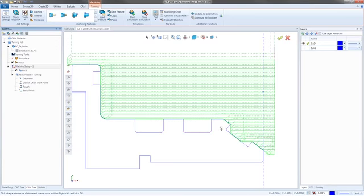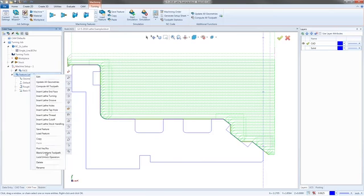There it is. So it did not ignore the angled groove, as you can see. It did go in there, which again, I'm okay with that. This tool can handle going in there and cutting that. I'd prefer it not to, especially if I'm going to set up a tool on that specific angle already. But the only way to get around doing the angled groove would be kind of how we did it in the past. You'd have to go in.